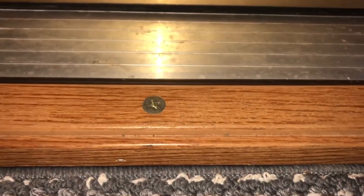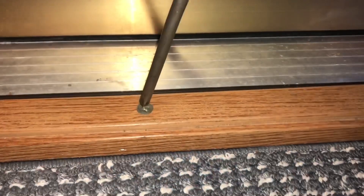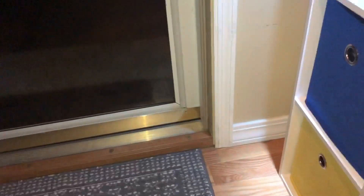I don't have the best lighting in my entryway here, but you can see these adjustment screws are just a Phillips head — a large Phillips head. You will need a number three Phillips for these, and the number three fits in there nicely. So as I back the screw out, it raises that sill. Let's close that up and take a look.